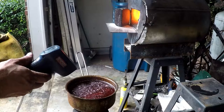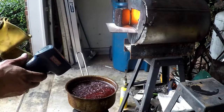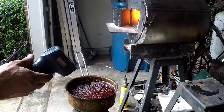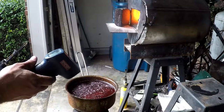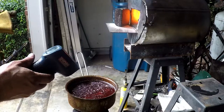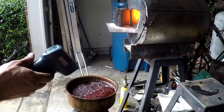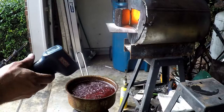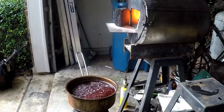Right now the oil is about 81°F — it's been sitting close to the forge, soaking in some heat. I've got the scrap steel in the forge, hot and ready. I'm going to put it in and get this oil up — over 100, 150, 195 — somewhere in that range. It'll cool a little as we're working while the other blade normalizes.